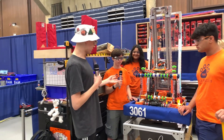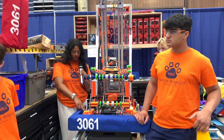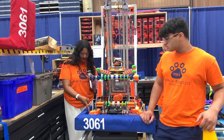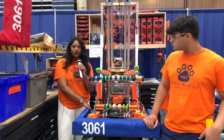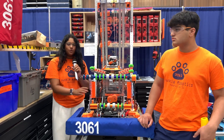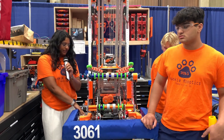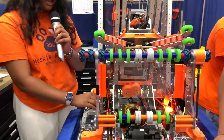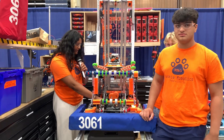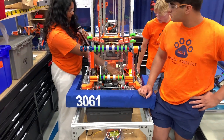Next up, we have Samika talking about their Swerve Drive. We have a 26 by 26 inch swerve drive using four MK4i swerve modules with Falcons. One really unique thing about our drivetrain is our electrical board is completely underneath. We have an electrical cavity within the two-by-ones where all of our electrical components are, with an aluminum plate underneath that secures everything. And we have a superstructure we call the H-frame, where our arm and intake are both mounted. Inside, we have our radio and our Pigeon, our breaker, and our RSL.